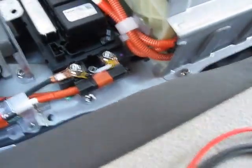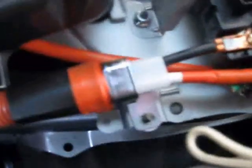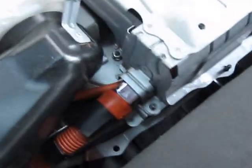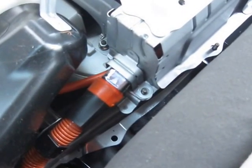I've also taken the cover plate and bent up one corner so it doesn't impinge on the cable. That gives a rounded edge to protect the cable from movement when it's installed. The terminals have been torqued down to 90 kilogram-centimeters. If you look carefully you can see the cable coming underneath and that bent-up edge of the cover is not pinching on the cable at all as it goes under the blower.